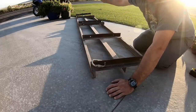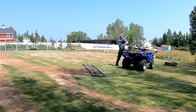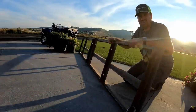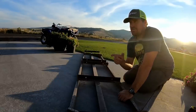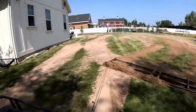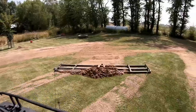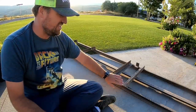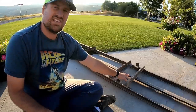If I was to do this again, I would probably make it about 30 inches wide instead of 20, because with a big pile of sand the drag can actually flip over, and I have to get off the machine to flip it back. That actually only happens in the beginning when there are piles or mounds from a wheelbarrow or wagon — once things are roughly flat you don't have problems with it flipping. I would like to add another 10 inches if I built it again. You can run the drag in either direction — with the C towards you or the flat section leading — that's why I put two attachment holes, one on either side.